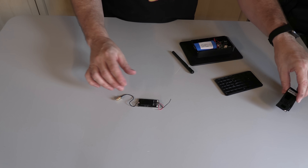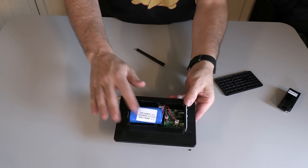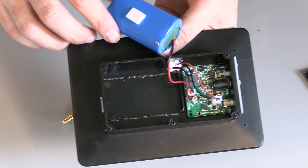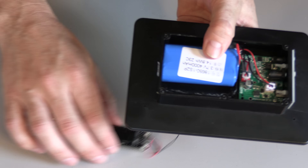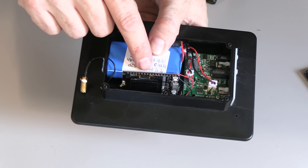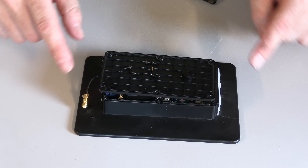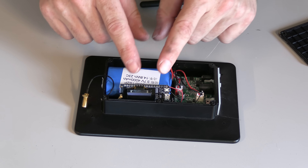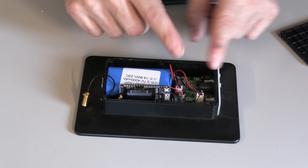I've taken it out of the 3D-printed case. I've also taken my little solar charger from Amazon and started doing some surgery on that. Normally this comes with a little battery box molded into the plastic, but I've cut that out so I can push the battery over slightly. That gives me room to cram the TT-GO circuit board in here and then close up the case again with everything inside. I want the antenna to stick out, so I've got to drill a hole, then hardwire this into the charging circuit so it can run from the battery and the solar panel.